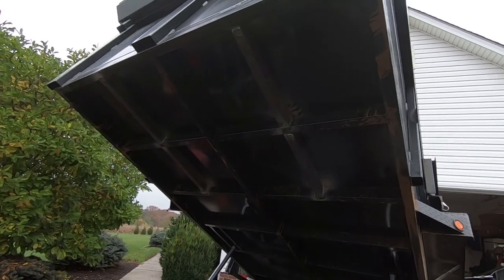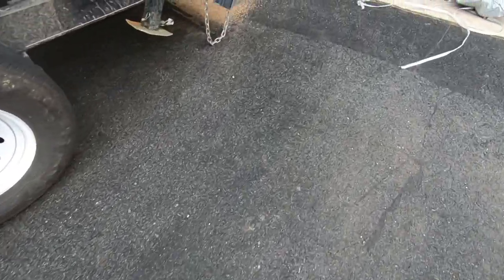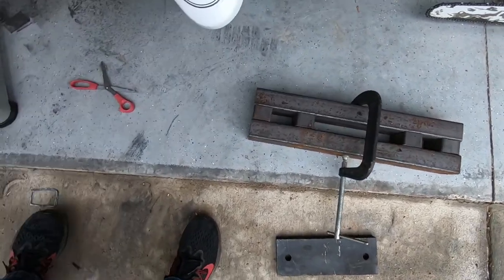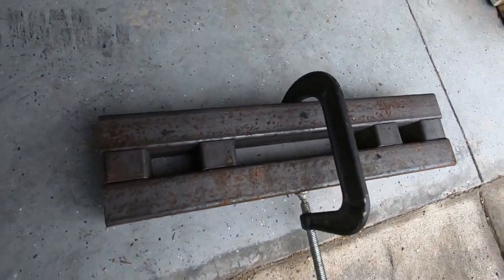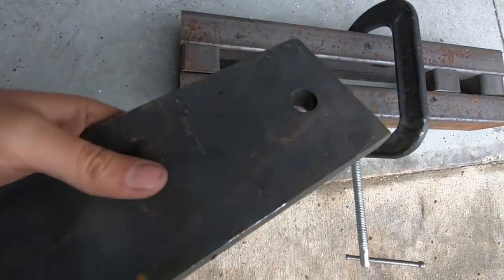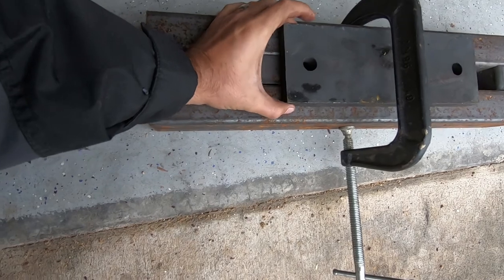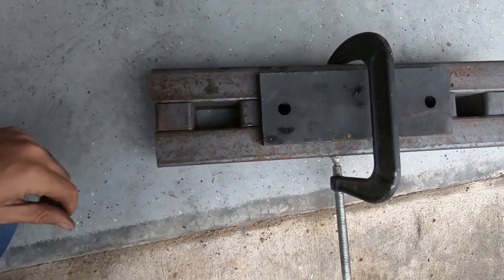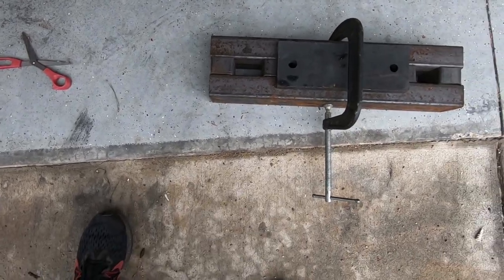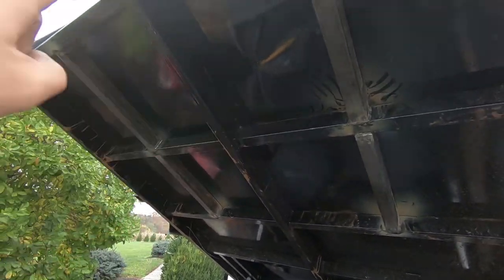We have the supporting cross members in, and I'm in the process of building the channel bracket that is going to hold this. I took my other two remaining pieces and I'm going to build an apparatus like this. This is a steel plate that the vibrator mounts to, and there are threaded holes in it. I'm building an adapter that I can weld this onto — that'll be what the rotary vibrator attaches to. Then that whole assembly will mount right up along here.